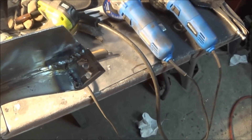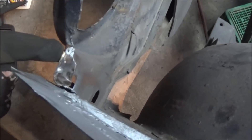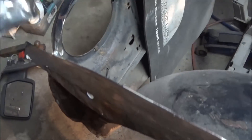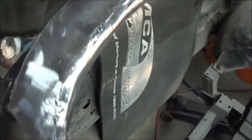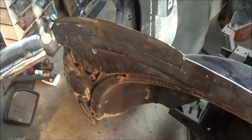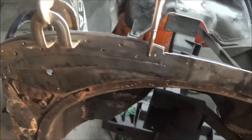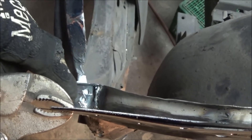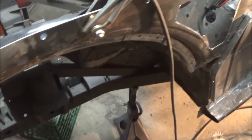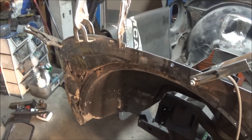This flange piece is just about done - there's the nose piece that fits up the front and attaches to the front valence. It fits on this little pedestal and gets spot welded to that. We're pretty much ready to weld this in - we're just going to give it a coat of zinc primer. I've already got zinc primer on the inside flange. We'll give the back a coat too, drill some holes for spot welds, and then go ahead and weld it in. Everything's in place and looking good, so we're starting the plug weld procedure, welding solid all the way along, then the rear flange and spot welds at the front foot. Quite the process - a lot of work and hours spent in this little area, but it had to be done.